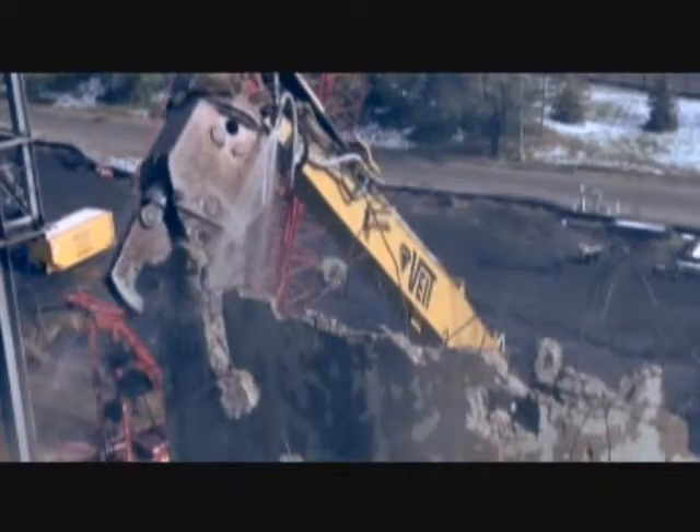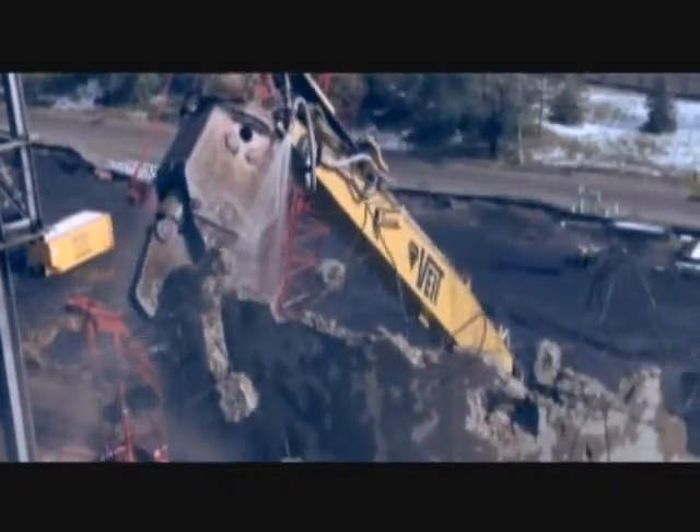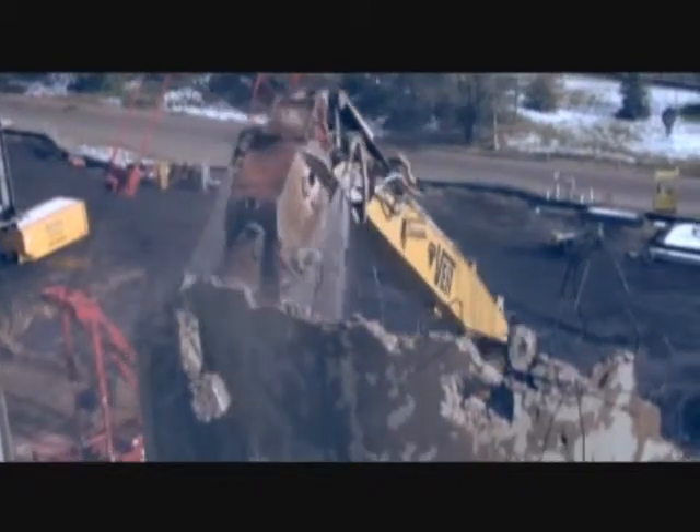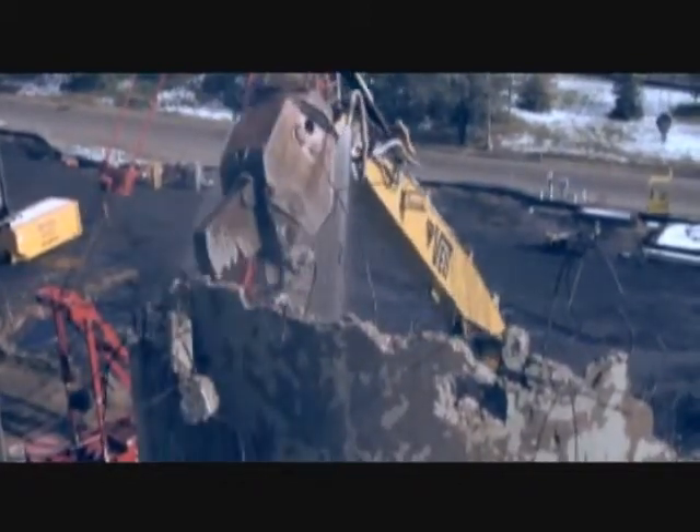So pound out — what exactly are you talking about when you say pound out? Pound out is really when a big piece of equipment slams repetitively either into earth or rock, or just slams the bucket repetitively back and forth — like when you see that bucket coming up and down on a front end loader. When that occurs, all of that pressure from that heavy load is pushed directly onto the pins that hold that bucket to the piece of equipment.